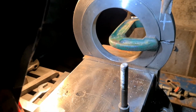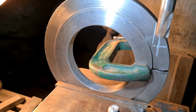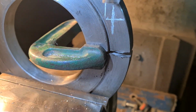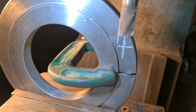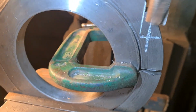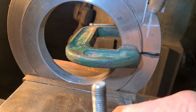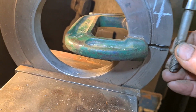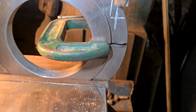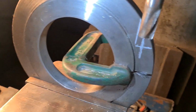Okay then, well this is the trumpet adapter for the back plate of the brakes, and I've split it in order so I can pinch it up so it nips tight on the trumpet housing. That's where the keyway is. And so I've just got to step that out roughly where a chalk mark is in order to sit that in there, but obviously in that area there. So I'll just mill a piece off so you can see what it's all about, and then I'll crack on and get it done.